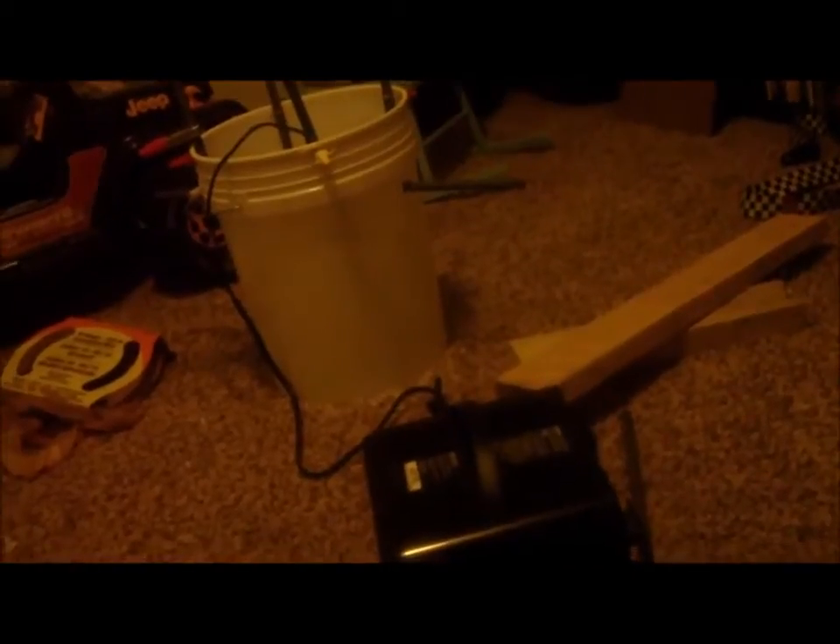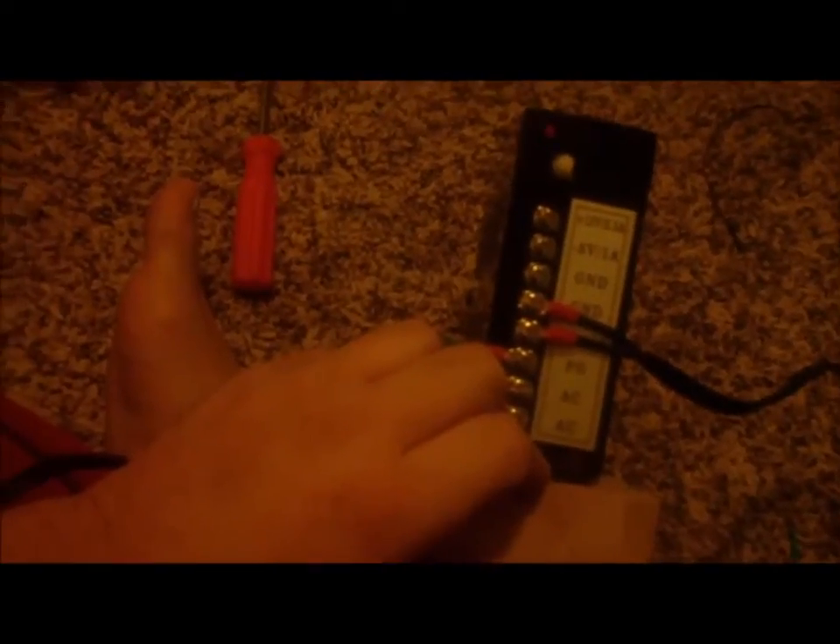Now I'm going to do some tests. I'm going to hook it up to my electrolysis bucket. Currently I have my electrolysis bucket running on my battery charger, but when I checked the output it was only giving me about 3 volts and maybe 300 to 400 milliamps. It's working okay, but I want to test this power supply to see if I can get a little more power output. I'm going to unplug that and hook this up and see what happens.